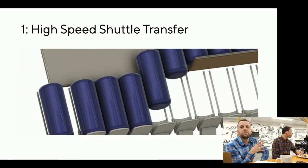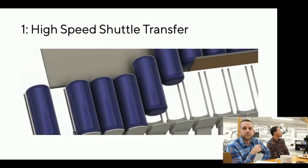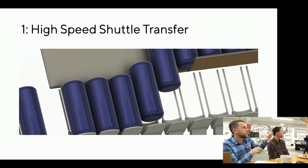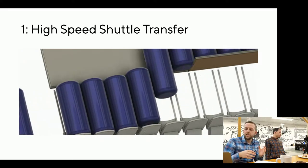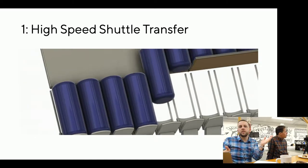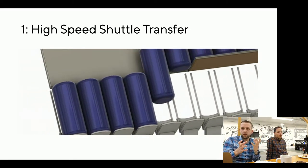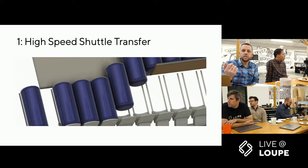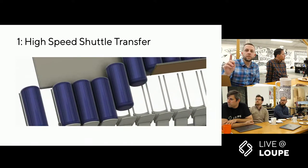The provisionals are filed, so don't even think about it. This is a high-speed shuttle transfer system. The drawing is cartoony so you'll have to use your imagination. You can see a kind of ribbed or corrugated conveyor coming in, L-shaped. At a certain point the floor falls away and the product drops down onto the shuttles. There are rails to hold them — I'll explain those in a minute. It goes down like a slide; we use gravity to our advantage. It's like a zipper — it can be done continuously. The shuttles can be controlled independently but we can make them behave like a conveyor during the transfer.